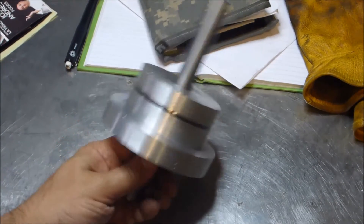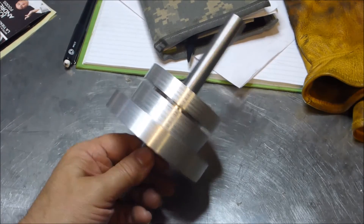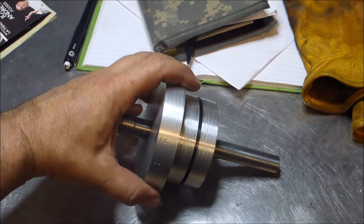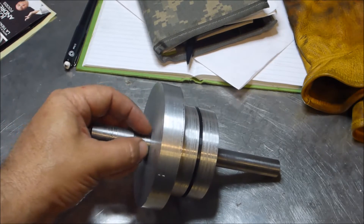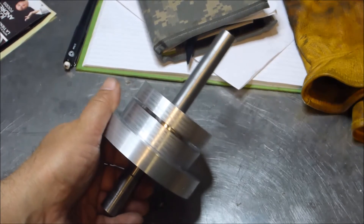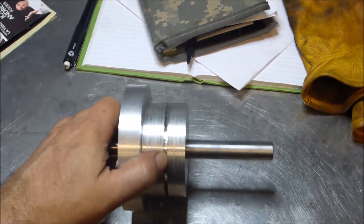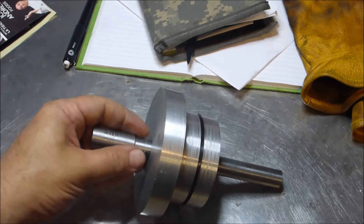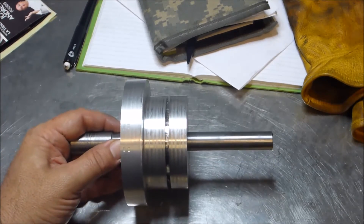This is how far I got with the pulley project so far. The reason I had to stop here is because this slug was spinning on my taper that I made. Either I didn't make it wide enough at this end, or it's because when I was trying to use the parting tool I wasn't that good at it — I caught it and put too much pressure on it so that it actually slipped out. I probably reamed this hole out a little larger than spec.